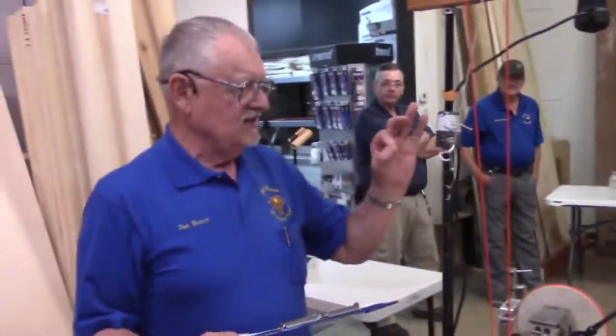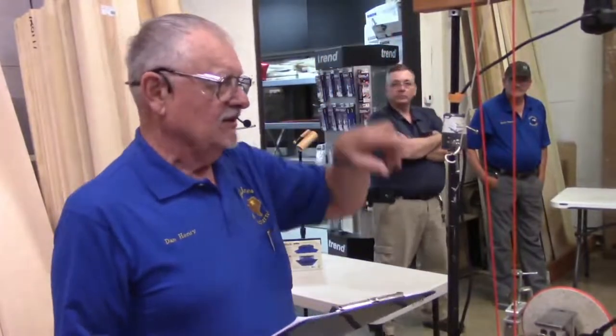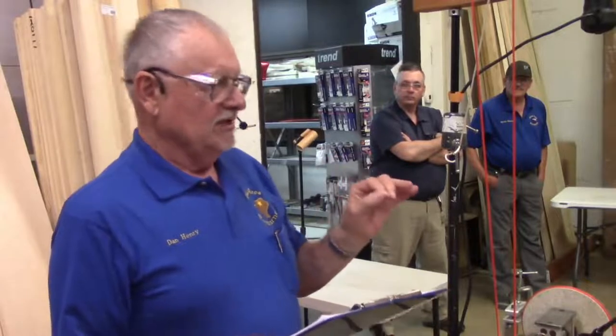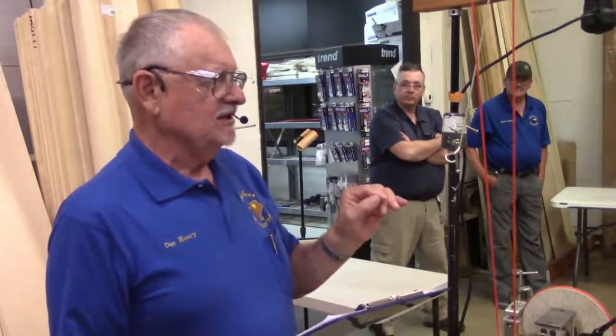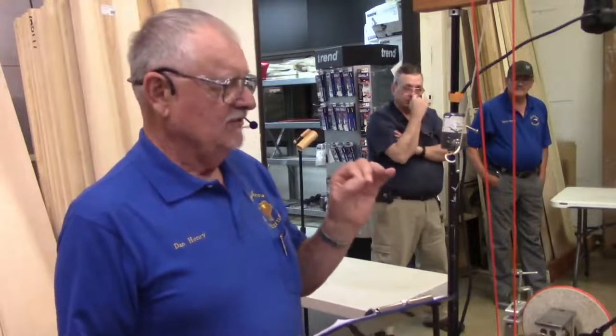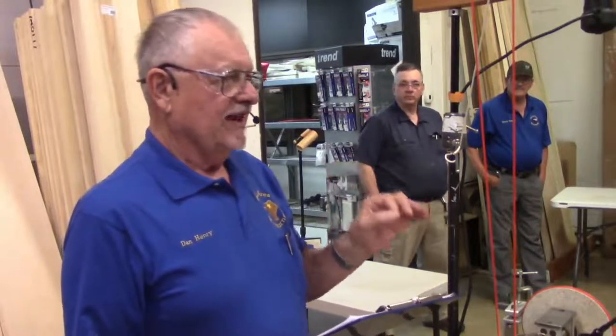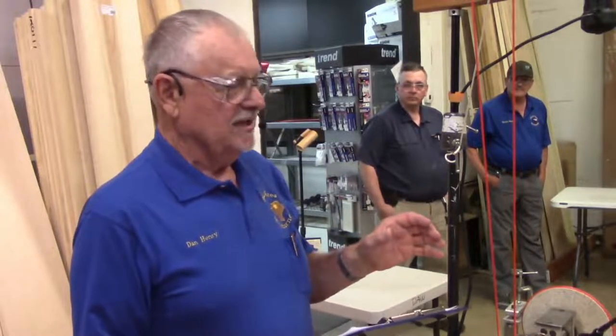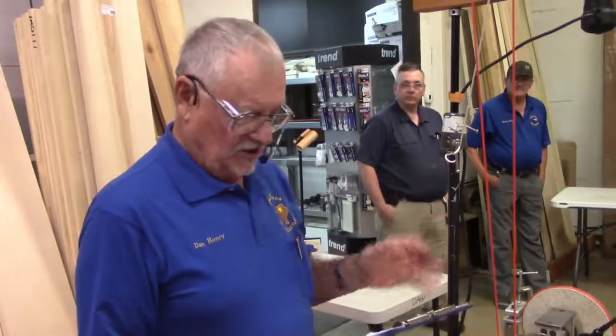A straight line jig allows the cutter to go straight up and down. It's used a lot for guilloche. With guilloche, you see a lot of old watch faces that had a pretty little zigzag or different design on them. That was guilloche. You're using a little carbide tip cutter that's actually just scratching the surface. It's only a few thousandths deep, but you have to set your machine up very, very accurately, because if you're off just a thousandth, it's going to show. So it takes a long time to set it up, but it's something you can do with it.